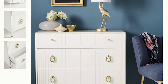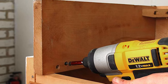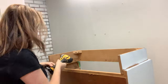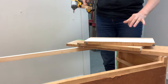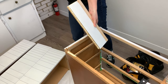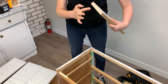I also wanted to get rid of the dated skirt and replicate the feet or legs that were on the Anthropologie inspiration piece. To remove the skirt, I flipped the piece on its top and unscrewed the three boards that made the skirt up — they were really simple to remove, just held in by screws. To make the base for the new legs, I used the long front piece of the skirt to create the new base to attach the legs to. I got to use my Bosch circular saw to cut the original front skirt in half.